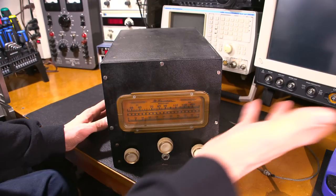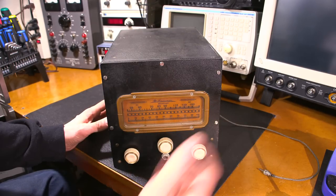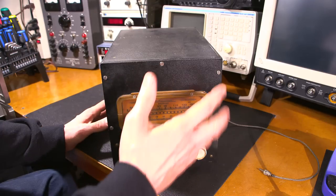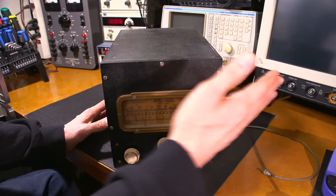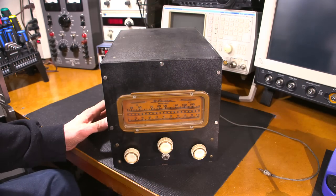And you're not only limited to two, you could have more of these things if you wanted, depending on how much money the hotel, motel, school, whoever wanted to spend on these things. Again, not having an oscillator in each one of these is absolutely crucial. So this way, one won't interfere with the other.